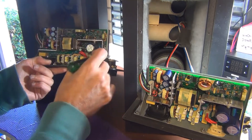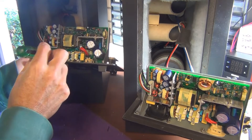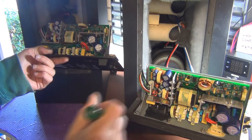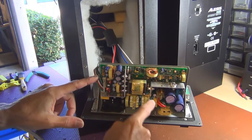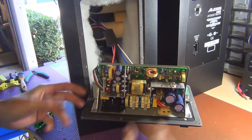I'm actually going to angle it over this way, just very similar to what the right-hand one was. So I'm going to remove this assembly, desolder that capacitor, and put a new one on. I think I've got a spare capacitor for that one. I'll put it on a slight angle, same as the right one. What I'm going to do first is remove this board, take out the power connector and the switch, and ultimately remove this board here from the chassis.